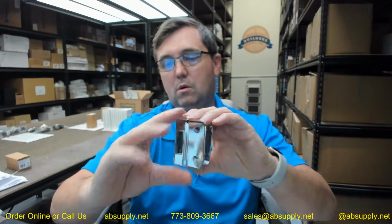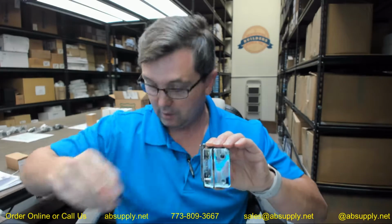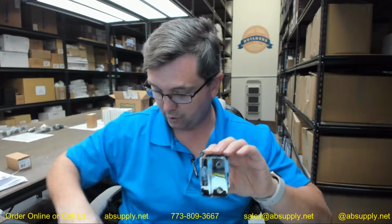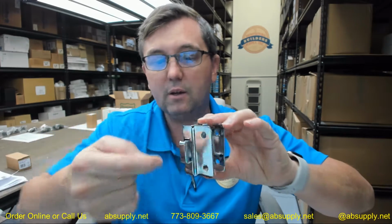So obviously your door is going to be mounted, and the stop is mounted to your door, let's say. This is typically used on in-swinging doors. So from this perspective, I'm on the outside, viewing the outside. You're on the inside, and this partition, this lavatory door, is going to open in this way. It will have the rim bolt attached to the face of the door. The keeper, or the strike, will be right out here so that when the door closes, I'll be able to lock my bolt right into the strike prep that's there.